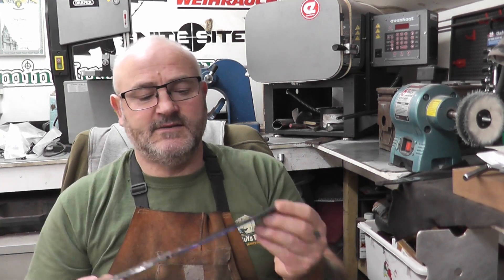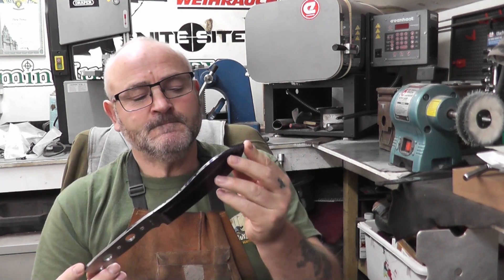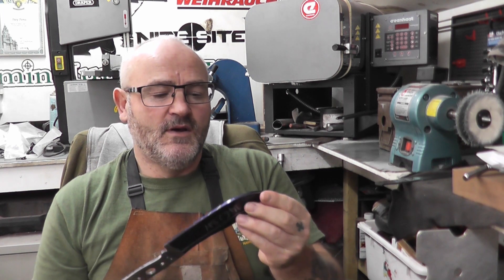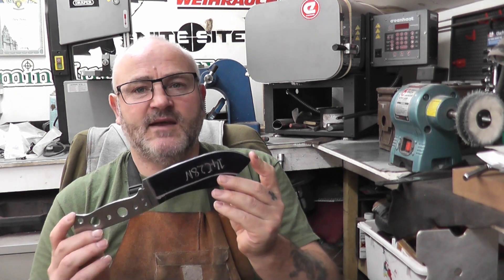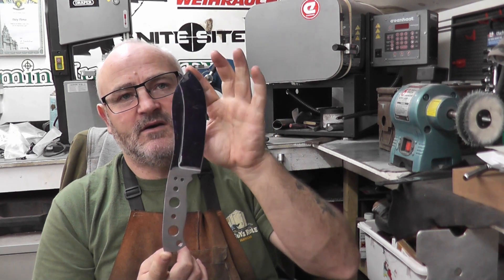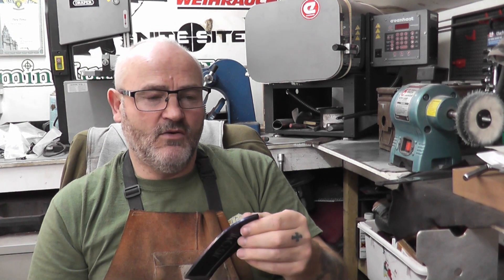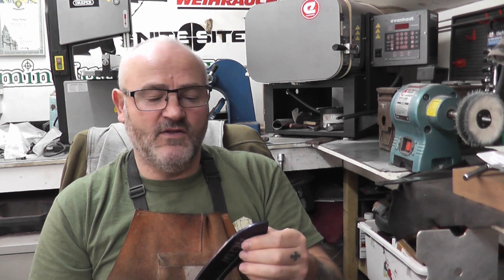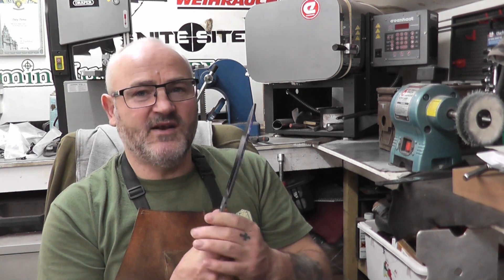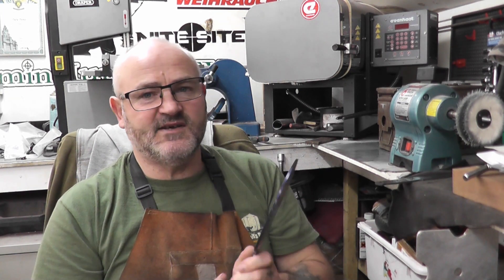The third test is going to be this knife. These knives are not going to be snap tested because I know the grain structure is good — it's the Rockwell hardness after tempering I'm looking for. On this one I'm going to aim for a higher Rockwell of 59, because although you lose some toughness on the blade, you gain in edge retention. So there's one sacrifice for another gain, and I need to do a little bit more research on the tempering cycle for that.